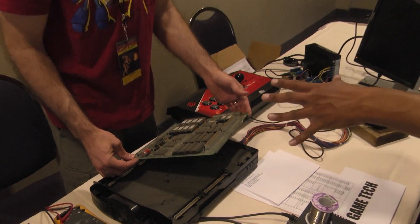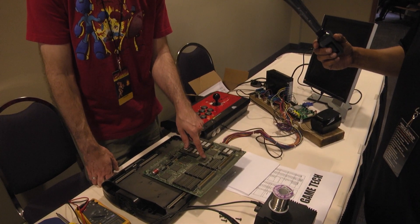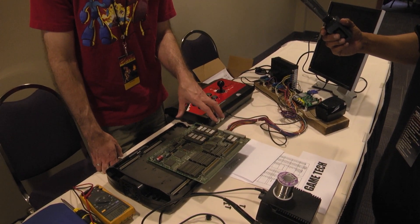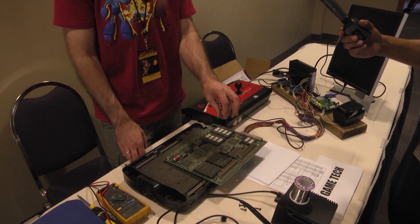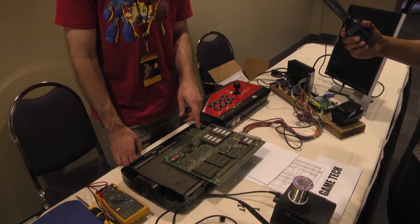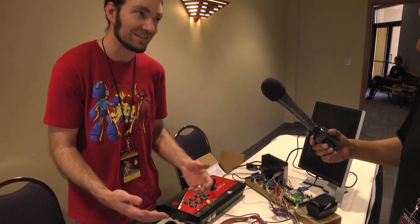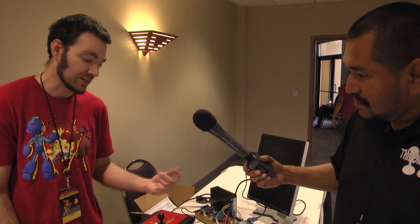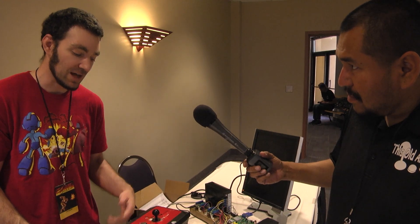So can you explain the theory about this? The battery, once it dies — this chip here has some RAM in it and it holds a few bytes of encryption data. The original program doesn't run unless it has that special encryption information, or at least it can't make sense of it. Once the battery dies, that sensitive information goes away and the board isn't technically damaged at that point, but it's not running properly either — we saw our pink screen, that's not very useful. Originally, operators would have to send that back to Capcom, they'd put in a new battery, insert the original key, and it would work. The nice thing about the Infinity Key is that every time you boot up it writes the proper key, and you don't need that battery anymore. You don't have to modify your ROMs. And if for whatever reason you want to go back to battery, you could — you're not harming anything by installing the Infinity Key.